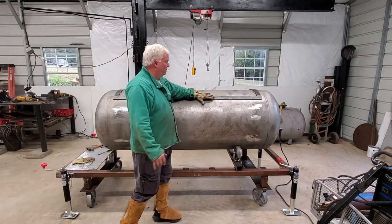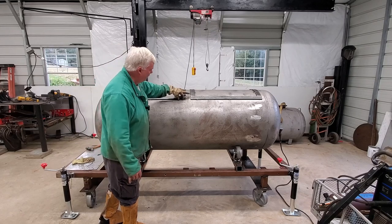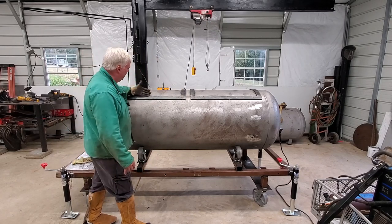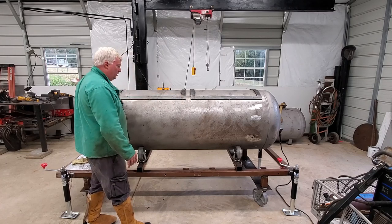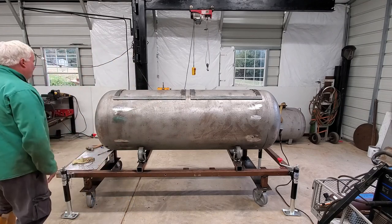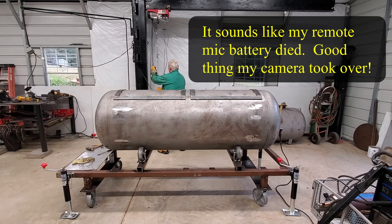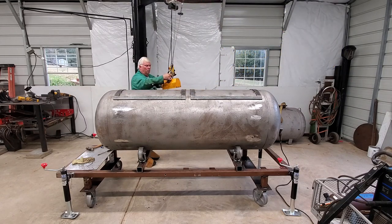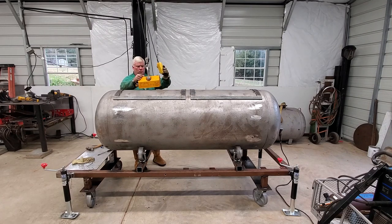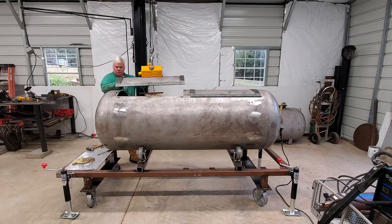We've got the horizontal bands on the top and the bottom. I've gone ahead and nibbed the little tacks loose, and I tacked it in three spots across the bottom because when you put these welds in right here, if you don't have it tacked down it'll want to pull that door band material up. So just put a tiny little tack — just enough to hold it down so your weld doesn't pull it up. Let me get the magnet and we'll lift that up. And if I've got everything cut loose it should come right out.